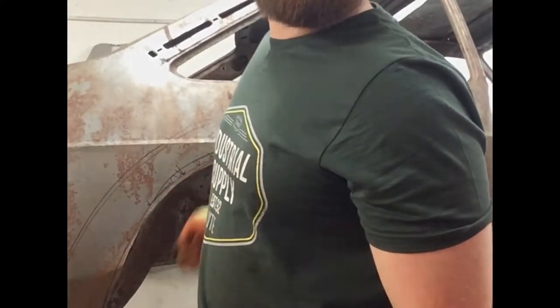I've just done my first run around the arch with the pliers, putting about 20 degrees of bend into the steel. You can see here I'm using the pliers with my reference mark so each bend is the same distance in. A couple of runs and we should be good.